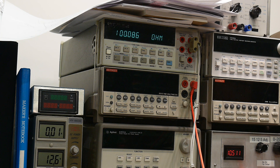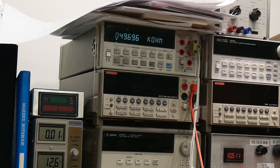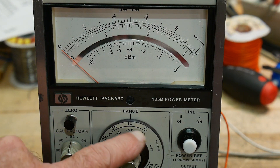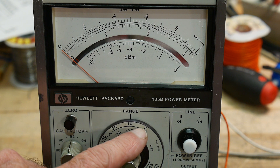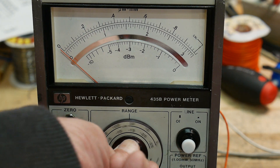So it goes from 100 ohms to 100k ohms, following a 1-2-5 sequence kind of thing. The values I used are just the values I had in surface mount, and I seem to have enough of them to cover all the ranges. I'll figure out what those ranges actually are, and then I'll make a little dial for this saying how many microamps or milliamps per step it is. That'll be good enough for what I'm doing — it doesn't have to be exact.